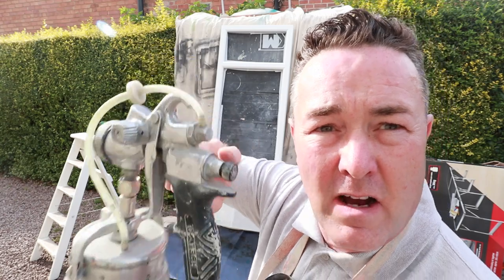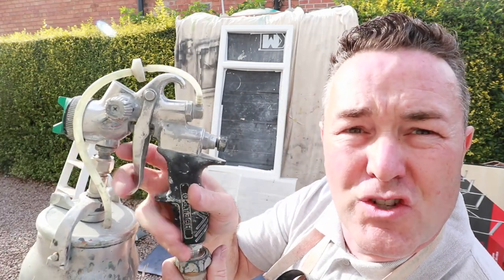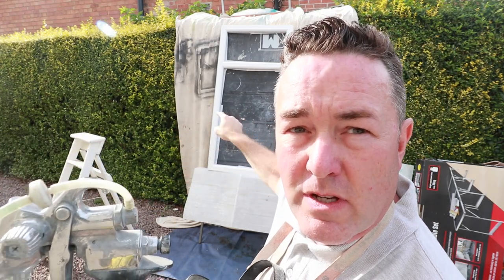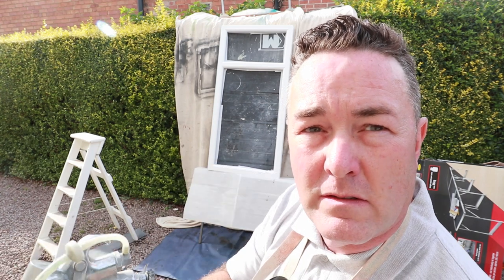My next thing, I'm going to dial it all the way in. That's just letting air out, no paint. As I let that back, let a bit of paint out at a time. For that first mist coat, I'm only going to get a fine mist of paint going on. Follow me? Good. Got my sample piece there, just going to have a practice.